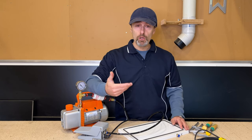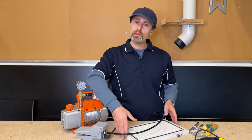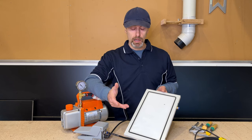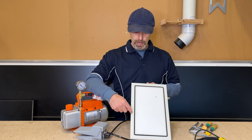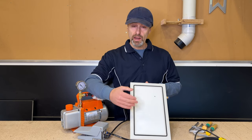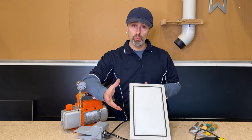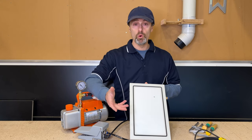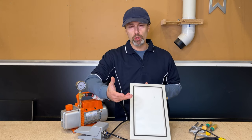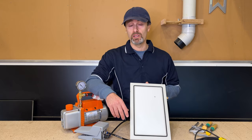So I used a bit of PVC glue mixed with the water, and that sort of worked, especially on the surfaces. By the way, this routed inlay here that I did is optional. You could get away with not doing that. You just have to make sure that you leave an edge after you seal, when you do your router here, because you don't have to router that whole section. You could actually do a grid pattern if you wanted to, but having more area to suck does help with vacuum suction. So I would say that if you are going to do this sort of thing, you would need a little bit more experience using a router or a trimmer. But like I said, if you did have a CNC, well, happy days.